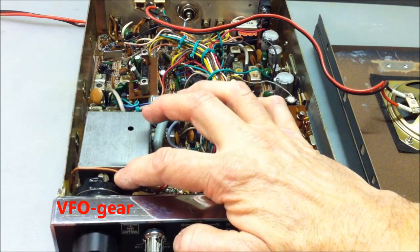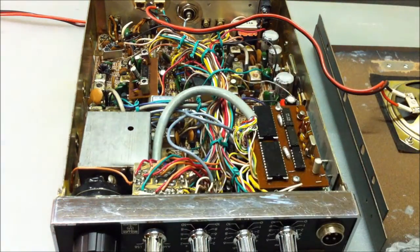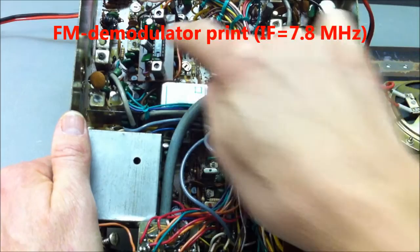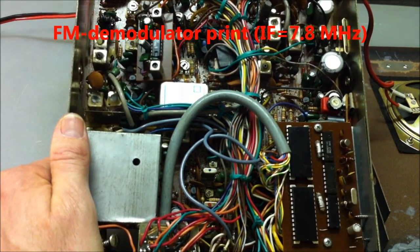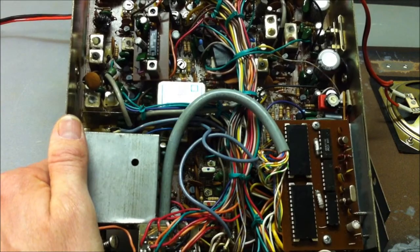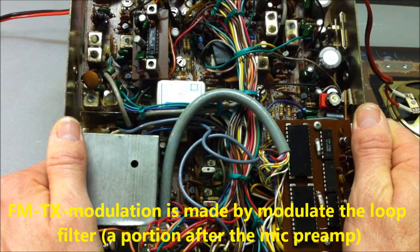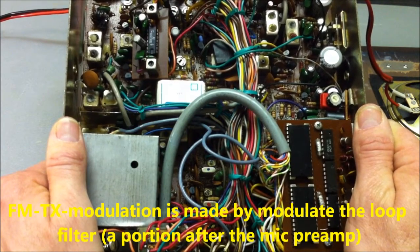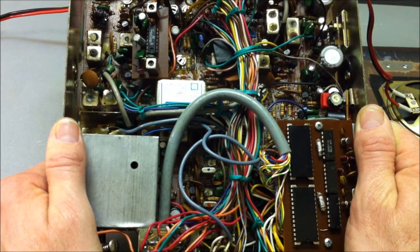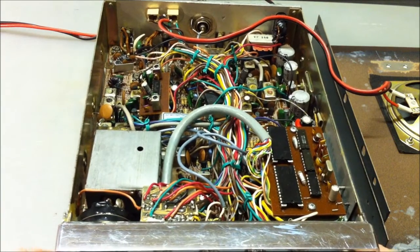When I turn the flywheel knob with the low gear, this screw moves very slowly. Another modification we can see is the FM modulator print here — 7.8 MHz IF. For FM modulation input, we need just a track from the AM modulation input directly to the loop of the PLL synthesizer, and then we get good FM modulation.